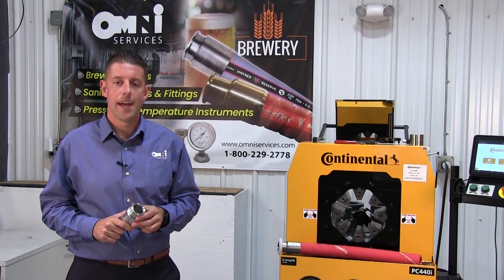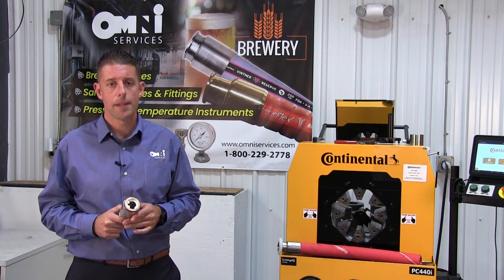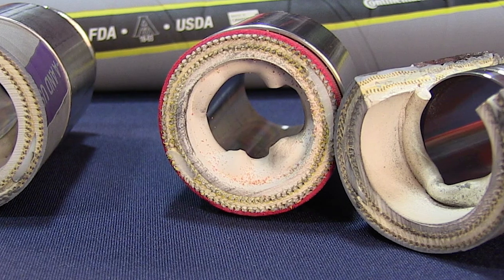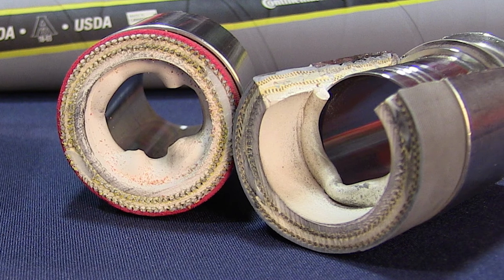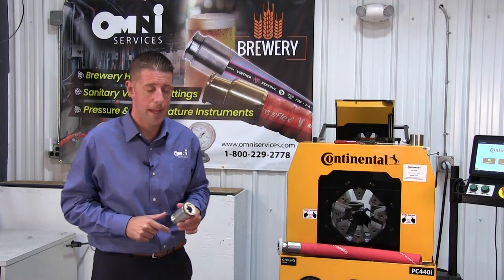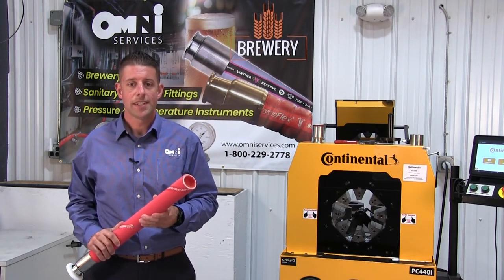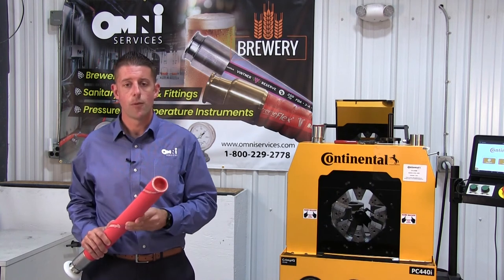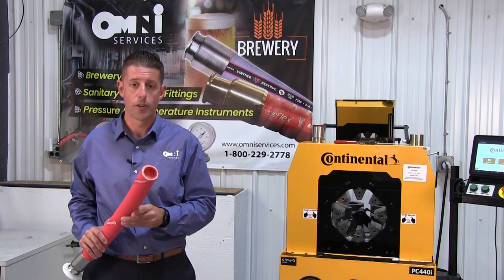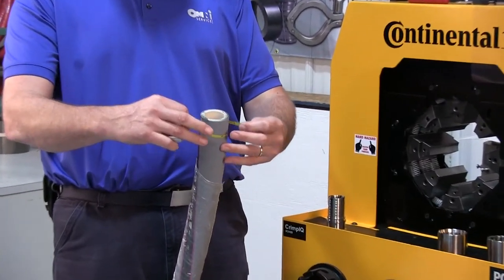One of the primary issues we notice in the market today is improperly crimped hose assemblies. An improper crimp causes puckering of the hose, especially after a clean-in-place process has recently been completed, potentially causing issues with bacteria growth where cleanliness is a number one priority in breweries. Due to the softer tube material in chlorobutyl or EPDM, hoses can become over-crimped when strictly following manufacturing crimp settings. Brewery hose is manufactured on a mandrel, which can cause very slight differences in wall thickness. This means that one end may not have the same wall thickness as the other, and even 1/64th of an inch difference in wall can cause an over or under crimp. Therefore, each end must be individually sized for the right crimp collar and then crimped gradually until it meets tolerance.